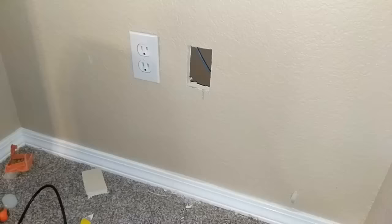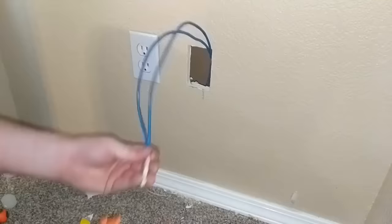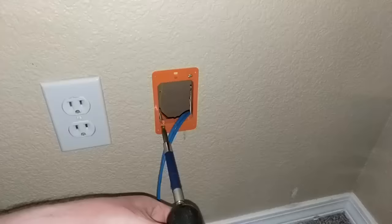Once the hole is drilled, carefully push the cable into the cavity, pushing up a decent amount if you can — more is better, as long as you have the length to spare. Come back up to the hole you've created in the wall, reach in and pull it out, but leave a little slack. Slide the cable through the wall box, push in the wall box carefully, use the drill to secure it to the wall, and be careful not to pinch the ethernet cables.